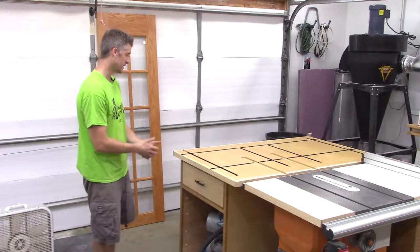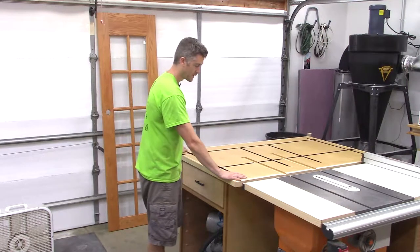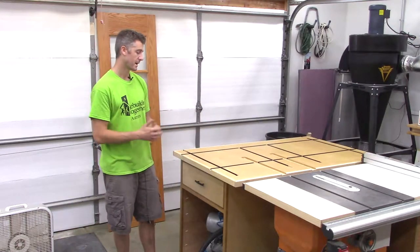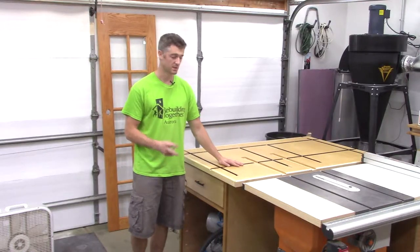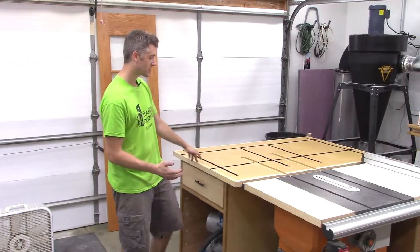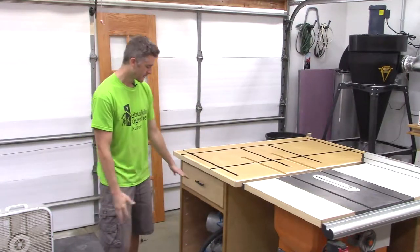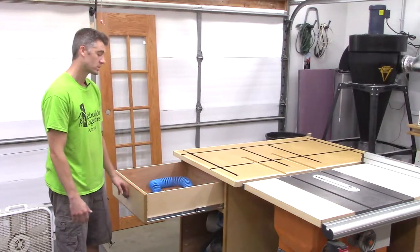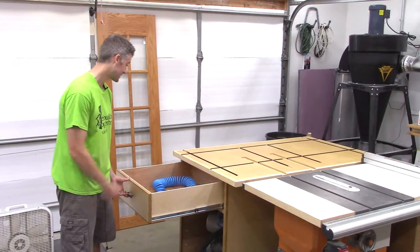The statistics here: about 58 by 36 for the top. It's got miter grooves to use with some of my jigs and miter gauge, as well as T-track in the top. The top is made from two pieces of three-quarter inch MDF, trimmed out in a combination of ash and maple — just some leftover scrap. The bottom has two big open areas and two large drawers. Right now they hold some clamps, an air hose, and a hammer.